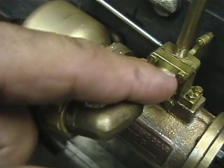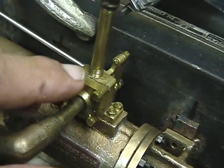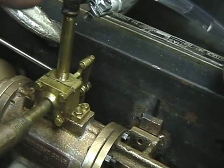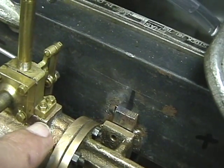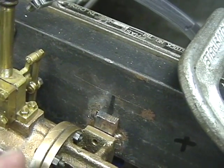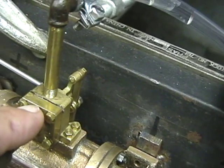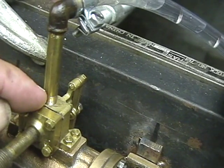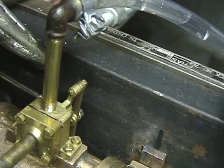This is the feed. The valve — I'll show you that in a minute — is underneath this cap. This is the valve body, bolted down, and the passageways go to one side. You can see this little bump here; that's where the passageway cuts through, drilled through into this side of the piston and one on the other side. They're connected to this valve — the feed comes in from the center and the exhaust goes out through the back side of the valve.